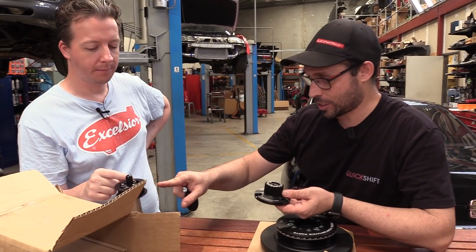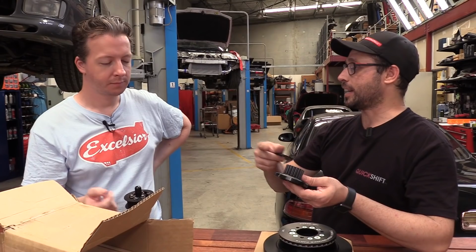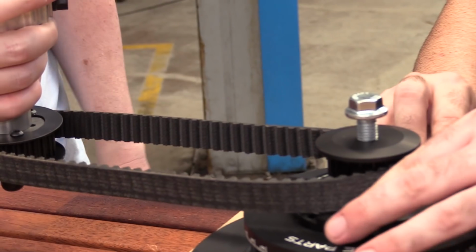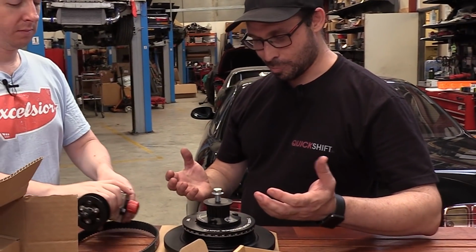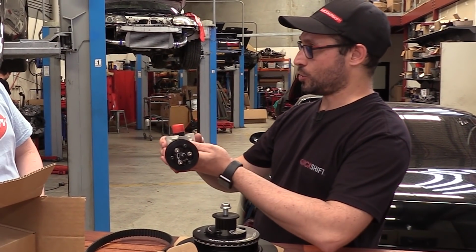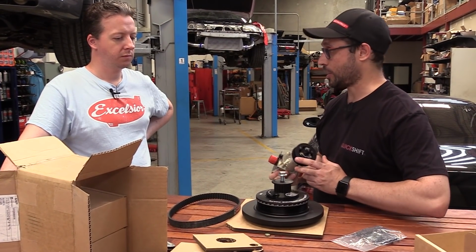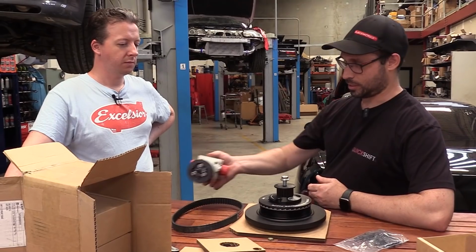The number of teeth we got on that pulley was specifically to get the pump running at the required speed for the required volume. Spinning the oil pump. We're making oil pressure. The reason I've been waiting for this stuff is because I need to make a bracket that attaches the pump to the sump. Now we've got it, I can get on with designing that bracket.